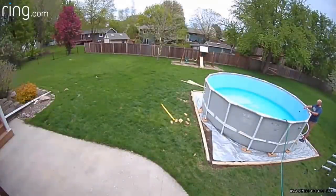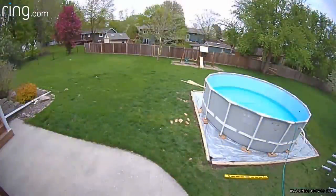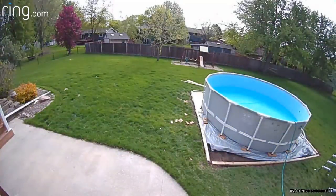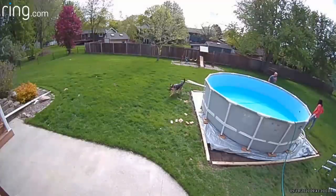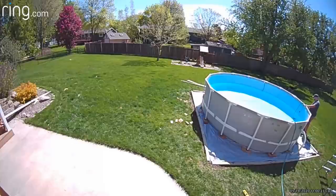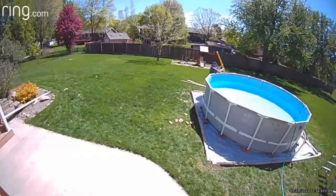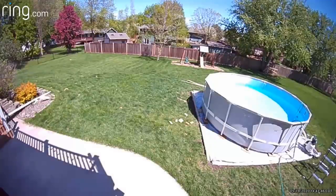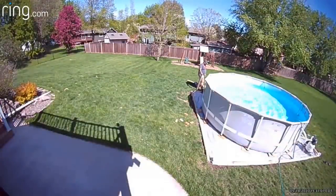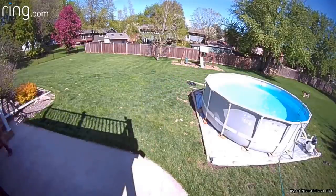As more water went in, I started to realize there was a pretty big problem. The top of the pool looked relatively level, but it was not. You can actually see the crease going from left to right. As the water kept filling, the pool started to settle and sink. The problem was I used too much sand on the far end — the near side had packed dirt but the far end had somewhat packed sand, so it sank. The feet started to collapse and sink down into the sand, and I started to panic.